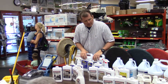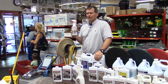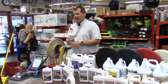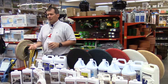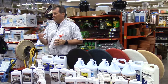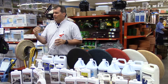One of the last products is a great niche item: Coil Clean. Most people landscape around their air conditioning condenser in the backyard because they're eyesores. Coil Clean is an organic salt acid that you spray directly on the coil on the outside of your house. Let it sit for three to five minutes, then spray it off with your garden hose. It's a great way to maximize your cooling dollars — it increases the circulation through your coil, increases the life of the fan, and makes everything you're doing to cool your house that much more efficient.